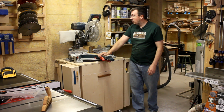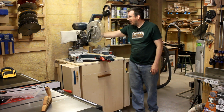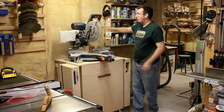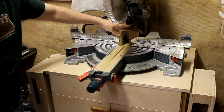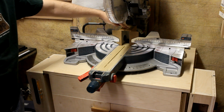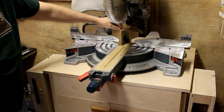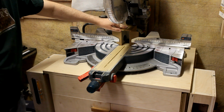Additionally, I decided to get the Bosch Miter Saw. It has a unique sliding mechanism here in the back where it actually folds instead of sliding on bars, which allows you to push everything flush up against the wall, really minimizing the footprint. I've made my own custom dust shroud for the saw, which sits just behind the fence. The vacuum port I put right down inside of it, so this allows me to capture even more dust for 90-degree chops, and this has proven to be remarkably effective.